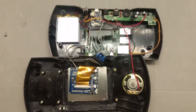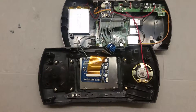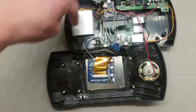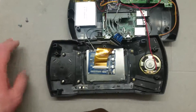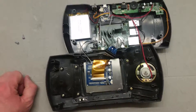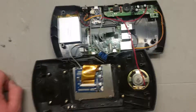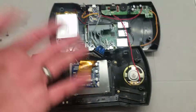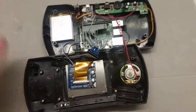I try to keep the wiring pretty clean — ended up in a pretty good position, not too much of a rat's nest, and everything is fairly well secured. I'd like to put screw standoffs with epoxy into the case and have nice screws to actually attach everything. I'm also considering de-soldering a lot of things off the Pi that you don't need. The nice thing about the Lynx is it's really tall and flat, so you can put a lot of componentry in here. If I de-solder this pin header I can make nice clean hard-solder connections straight to the board. The only downside is the SD card, which is buried right here — I could cut out that plastic and have some accessibility on the back.